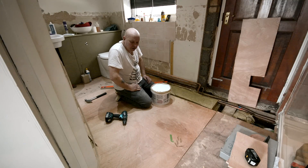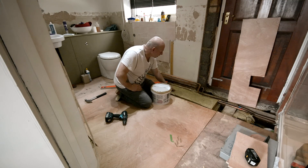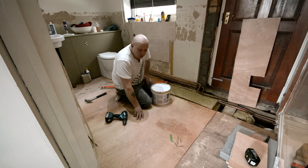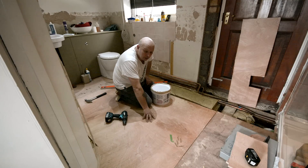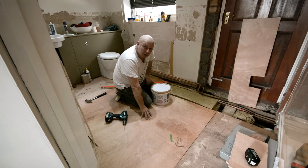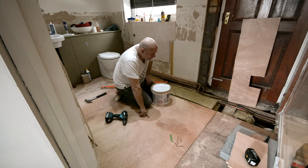The next stage: I've put a load of rock wool insulation underneath the ply — there was no insulation in the floor at all. Then the next stage is the WBP ply. I've got some Far Eastern WBP; I'm sure there's another name for it because it's better quality. And then it's time to glue down on top of that.